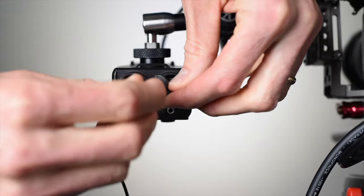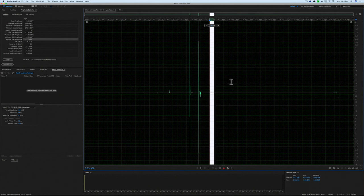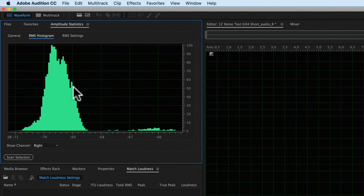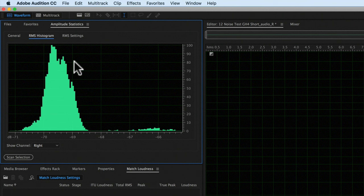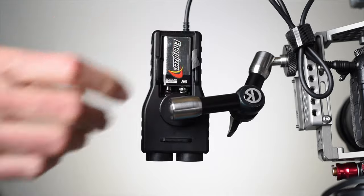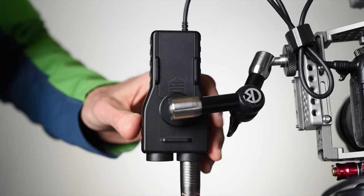To test the self-noise performance of the preamplifiers, we used the XLR inputs, turned it on with phantom power, and did not connect a microphone but instead shorted out pins two and three — essentially the two balanced microphone wires on an XLR cable. We found that the noise floor sat at -69 dB when recorded to our Panasonic GH4. That's very respectable; I like my finished audio to have the noise floor at -60 dB or lower, so this did great. We also did a battery test using phantom power and powering a microphone, and found that a 9-volt alkaline disposable battery lasted just over 12 hours — very impressive.